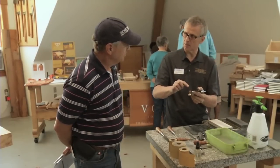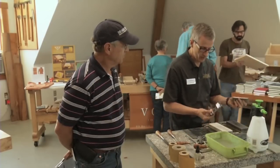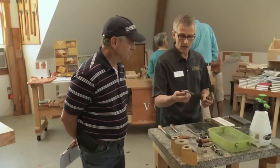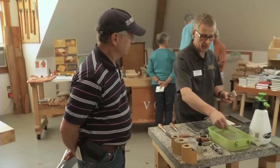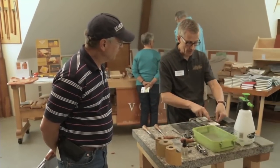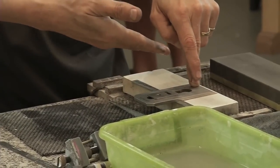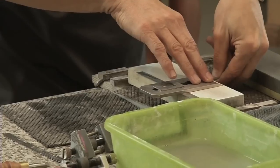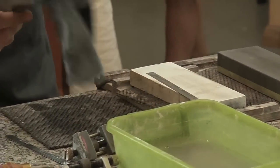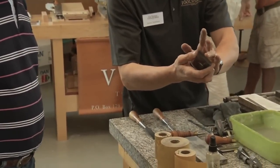We now have to remove the burr on the back of the blade and create the second intersecting polished plane. Remove the blade from the honing guide and take a thin ruler — a little six-inch ruler, approximately 20 thou thick. We attribute this method to David Charlesworth and call it the David Charlesworth technique. Place the blade back on the ruler, within about one-eighth of the edge from the other side of the stone. That lifts the blade by 15 to 20 thou and accentuates the pressure on the edge. A few strokes — two or three — removes the burr off the back of the blade, introducing polish at the back and the front, intersecting to create a sharp edge.